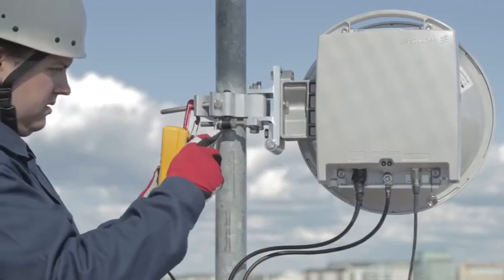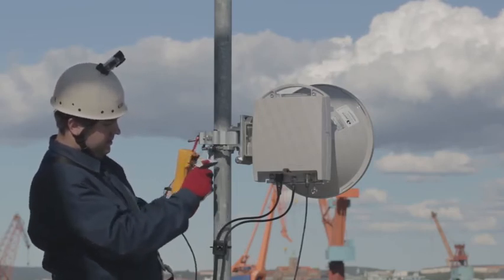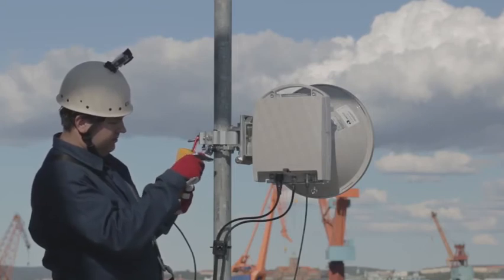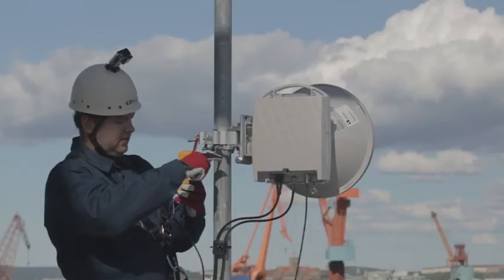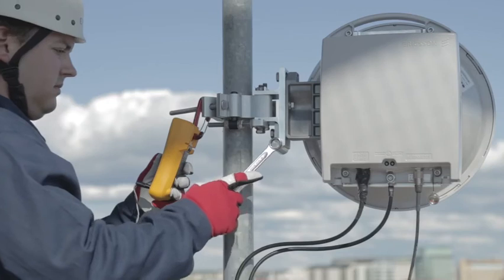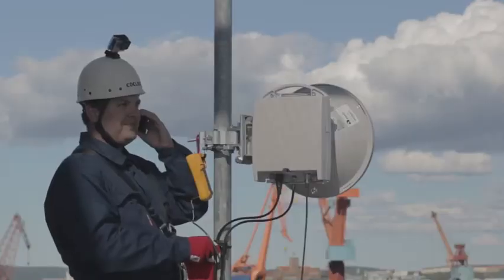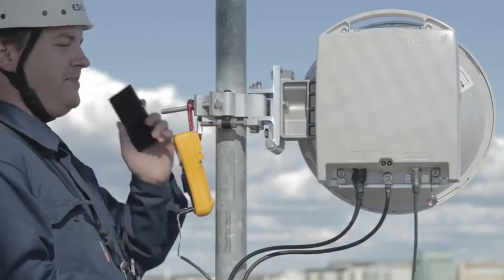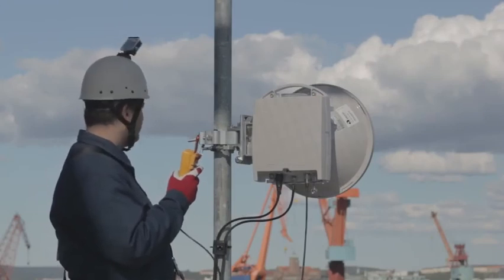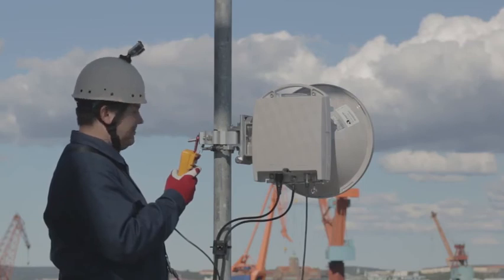Fine alignment is about finding the absolute peak — you should only have to make very small changes to the antenna direction. Search for the maximum reading in azimuth by carefully adjusting the antenna direction with the two azimuth adjuster nuts, then lock the antenna in place. Do the same for elevation using the elevation adjuster. When you are happy with the result, hand over to your colleague at the far end. The fine alignment procedure is then repeated at the far end — make sure that both antennas are aligned to give the maximum voltmeter reading.